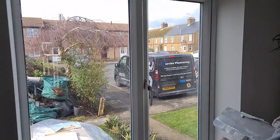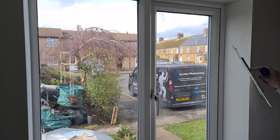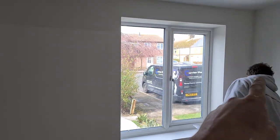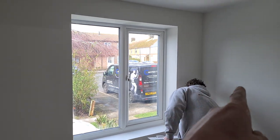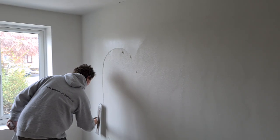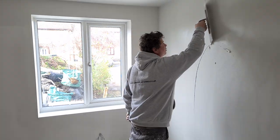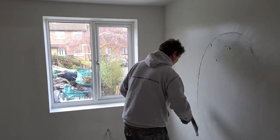Similar to when spraying a ceiling, we don't want to be getting spray plaster onto a finished surface when we come back around the room this way. So if he finishes that corner first, we can blend into what we've already finished, and he'll do the same on this corner here. So he's going to spray around the corner to the edge there. Obviously, he's chasing that tail on the plaster, sweeping it up into what we've already finished down from the ceiling.